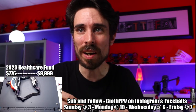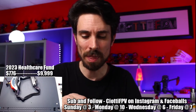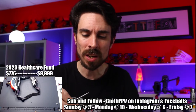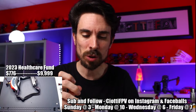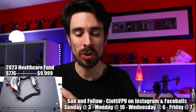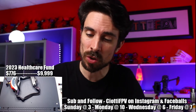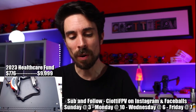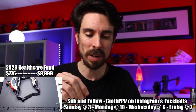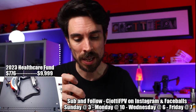I like that. Giddy Gimbals says, what kind of difference in flight time should I expect going from 0802 19,000 to 0702 28,000? That is unfortunately an impossible question for me to answer, Giddy, because the answer will vary with every single different pilot. If the extra power and RPM that you get from the new motors causes you to use less throttle, then you will actually get more runtime, because the 702s are lighter than the 802s. If the extra power makes you have more fun and use more throttle, then you'll potentially get less runtime. There is no answer to that question. Although if you ask that question on Facebook groups, you'll get plenty of wrong answers from idiots.